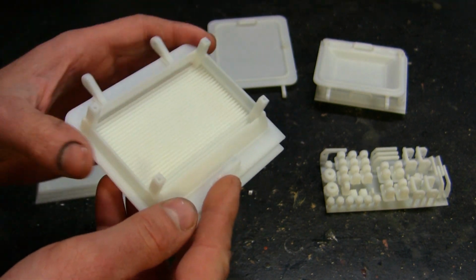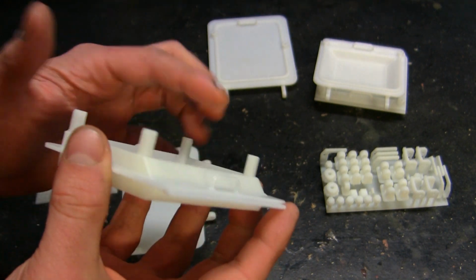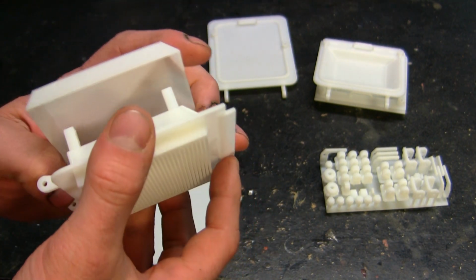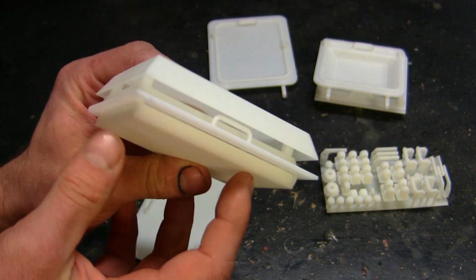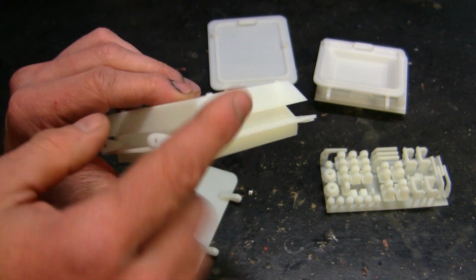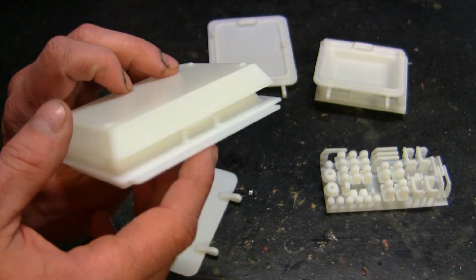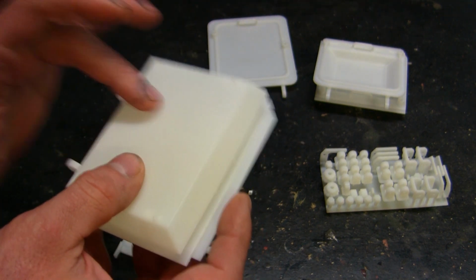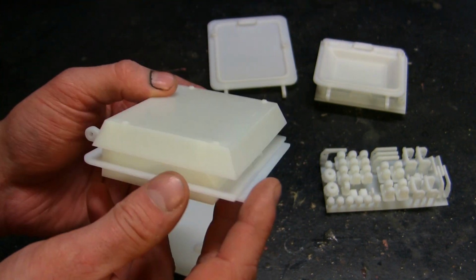What they did was they built up this little box section around the outside portion, and with these four long struts, they actually are provisions for mounting on a large steel duct. Basically, the duct plugs in place like this, and once it's in place, it allows the air to freely enter and exit the engine compartment. However, it makes it much more difficult for enemy fire or shrapnel or anything else you don't want inside your engine compartment to get in.